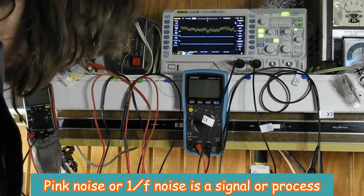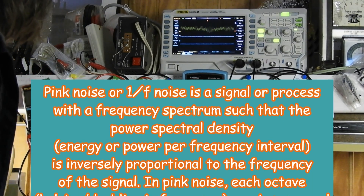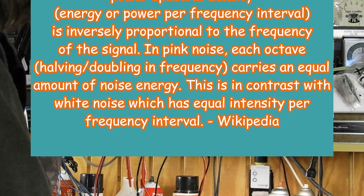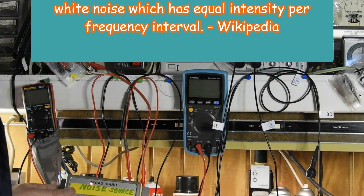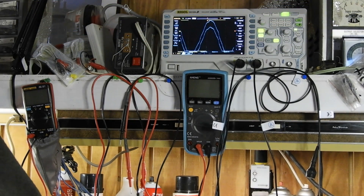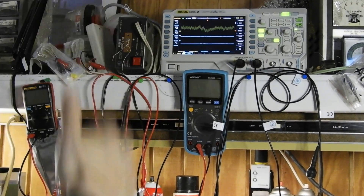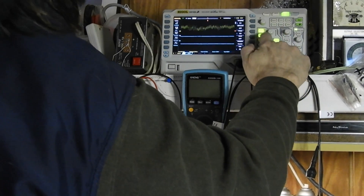If you're looking at a strictly linear analog scale... Both grounds came off — there's your hum, there's your 60 cycles, or 120 probably. The ground's back in. But the pink noise looks pretty good. The white noise, I can't explain how I'm getting that look. I've blown it up in frequency and everything else and it just looks strange.